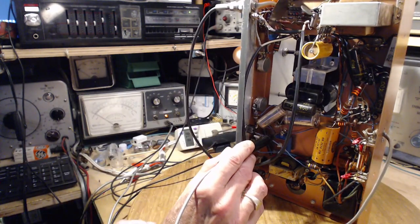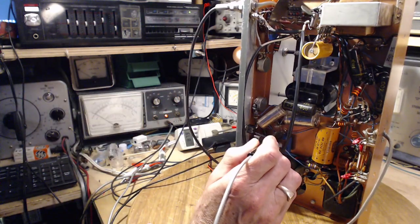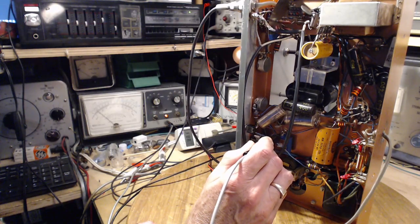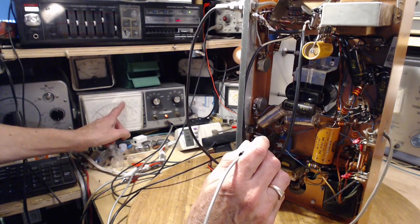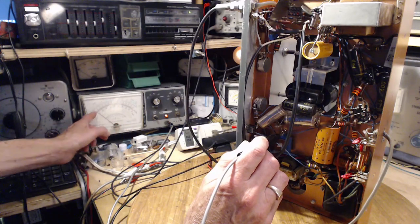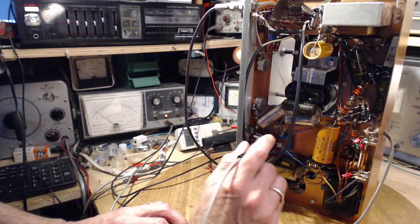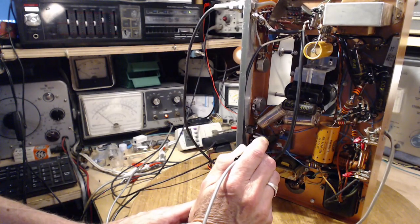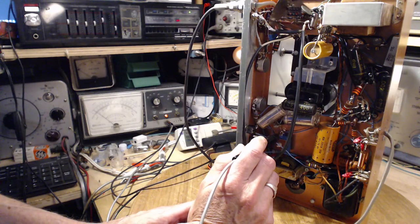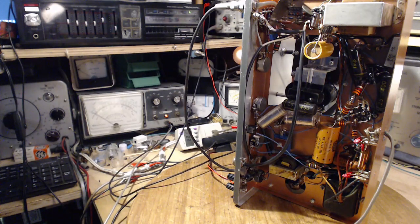The rectifier's right there, positive terminal's right there. Watching the voltmeter, this is set to 50 volts full scale. You saw it. My first time I tapped it there, I missed it. It jumped all the way up to here, probably could have gone much higher, then came all the way down to almost nothing. This is 50. This is less than half a volt sitting there. Take it off. Give it a moment. Let's take it back on. There it is again, as if the meter is drawing the charge out of the circuit. So that's the point last night that I stopped and said, ooh, we can start the video at this point.